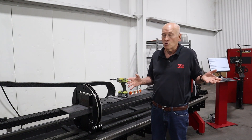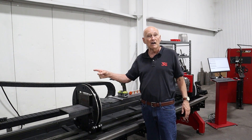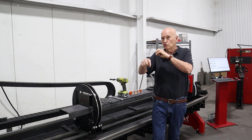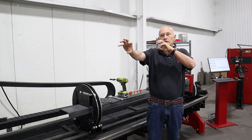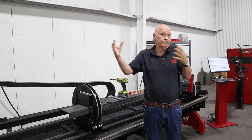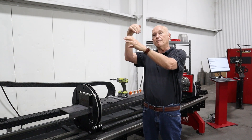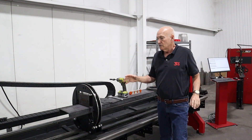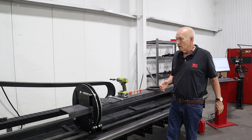That has to do with what we call wind-up. Let's look at an extreme: say you took a piece of two-inch c-channel and wanted to spin it using this big 19-inch ring. This thing turns out to be a really good flywheel. The XR series machines spin really quick, cut real fast, they're very powerful — so when you reverse directions you will actually wind up your workpiece and twist it. I'm not talking permanent, I'm talking during the cut process. As it winds up, when it stops rotation it backs up a little bit because it's unwinding, and it affects the cut quality. So you really don't want to use a large ring adapter for small workpieces.